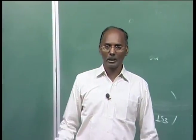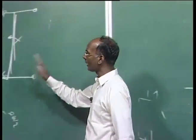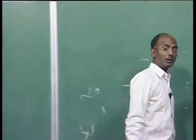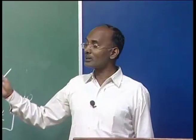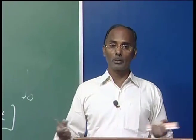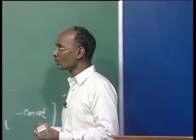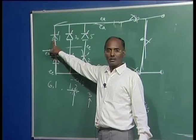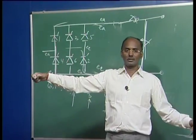It is done basically. Nowadays in a modern HVDC link, if you want to bypass, normally the same leg bridges are used, because we do not want to incur the extra cost. Because the bypass is not taken every day, it is monthly, maybe yearly, once there is some problem. And also, as I told in the beginning, it is not only one switch, it is not only one thyristor, it is a series of thyristors.